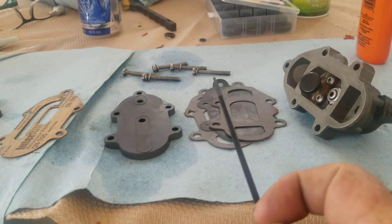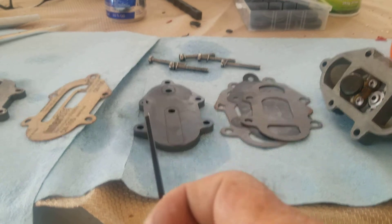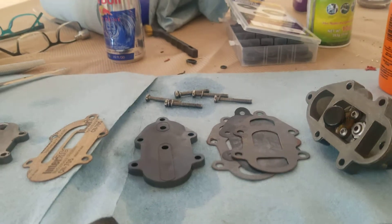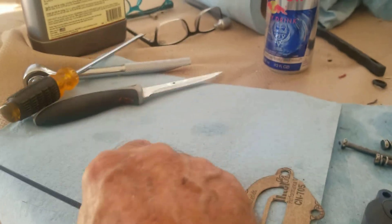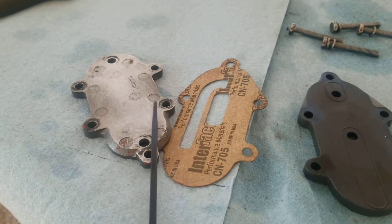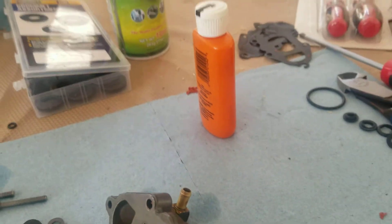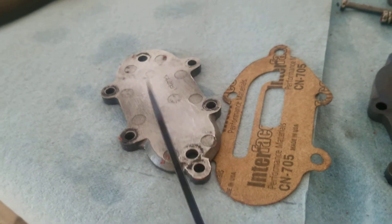It's sort of hard to get those bolts in and get all this stuff flush back together. I put some gun oil on these bolts and in the holes so they slip in easier and everything lines up. Just take your time and get it all snug together. I'm going to have to come up with some gaskets for this base plate — it doesn't fit flat, it's just got two little things that come up, so I'm messing around with some o-rings to find a way to seal that.